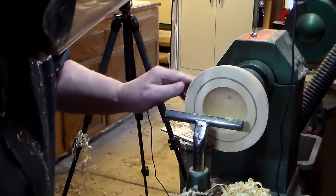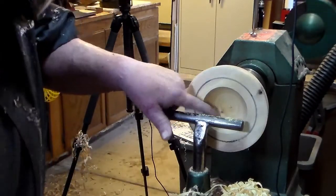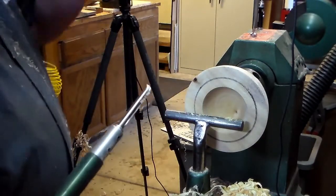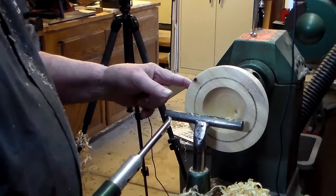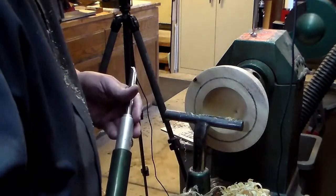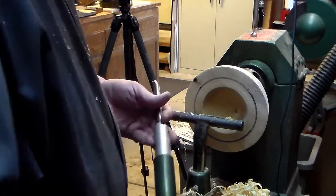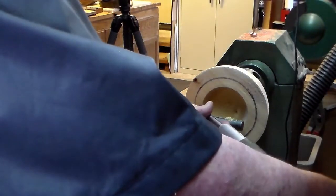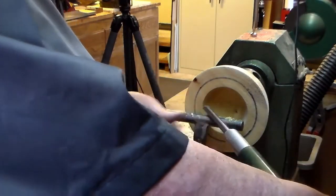Heard a little thumping. That's the start of that piece of wood coming through. Now, I'm going to work down just the first inch, like I did before, trying to match the outside curve here as best I can. Get that out of the way. I was running into it with my tool. So I'm going to come here, work out, down until I get to that area.